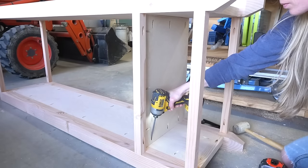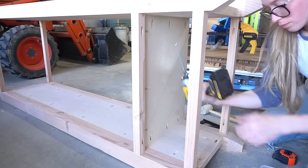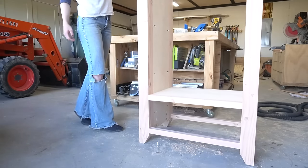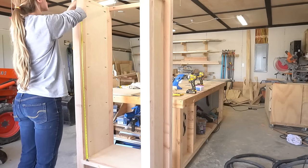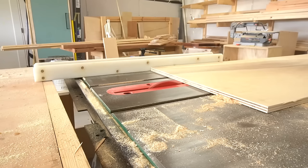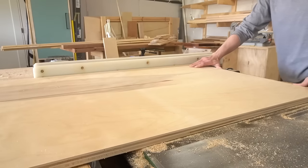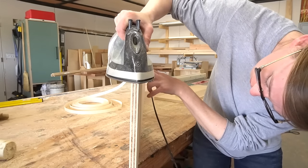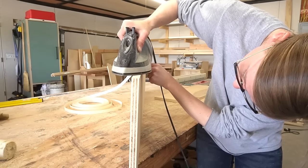I'll have to drill a hole into that piece later for the hinge, but for now I went ahead and cut and attached a piece of plywood flush to the top of the two-by-two as the bottom panel. With this piece installed, I could go back and properly size and cut my door panels and drawer front. If you watch the computer desk video, you'll notice I had to size the doors slightly smaller to use these pivot hinges — I'll document the door sizing in the plans linked below. I'm really glad I remembered to undersize them this time before I made them.